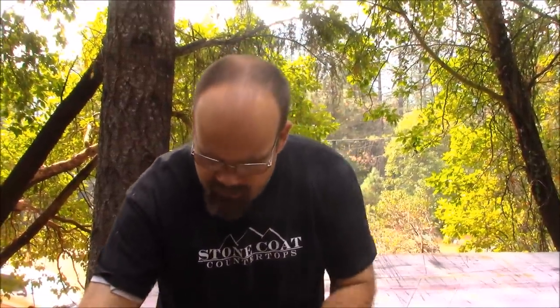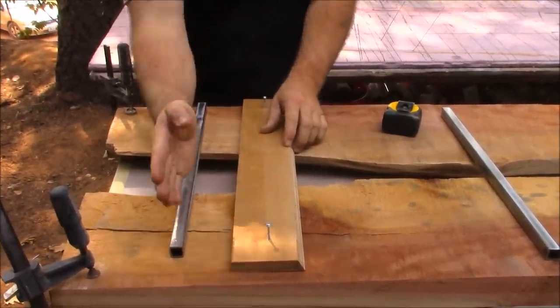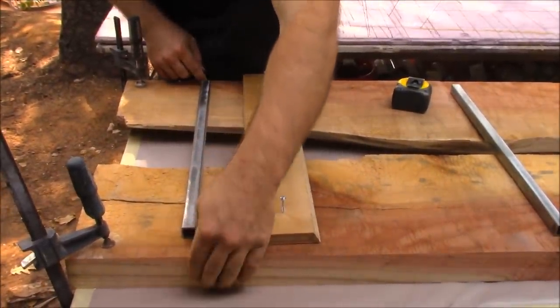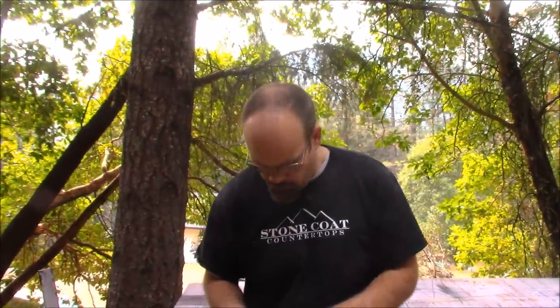We're going to take this three-quarter inch square tubing. You can see these natural fissures and cracks here in our redwood. I'm going to use my scrap piece of three-quarter inch plywood as a straight edge — screw it in temporarily so my router can ride this edge to create our joint. I want to make sure I don't go too far, so I'll give myself reference lines of where that bar needs to be. We've set the bar in from the edge so it doesn't protrude on the exterior. We're only looking for the cracks and weak points — we'll put our bars across those points. Because we're going to color it with metallic additives, you'll never see the bars.